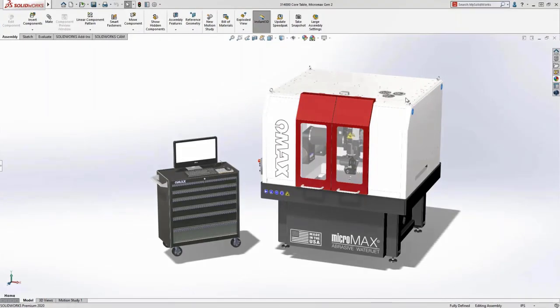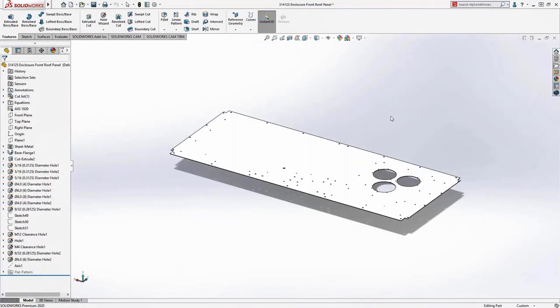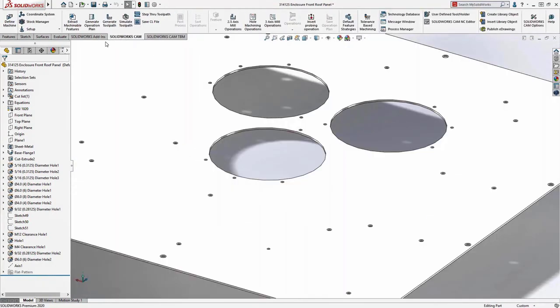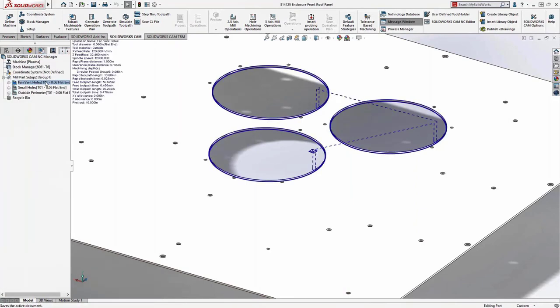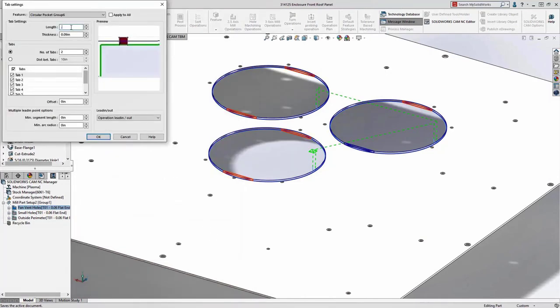So if I'm going to cut out these holes in this metal plate for my cover of my OMAX, one thing I don't want to necessarily have happen is the material that's cut out dropping into my machine as I'm doing this. So I might want to leave some tabs so they're kind of hanging on. I can use a mallet to knock them out after the fact. The way we do that in SOLIDWORKS CAM 2020 now is just add tab cutting to whatever